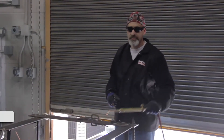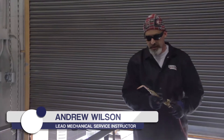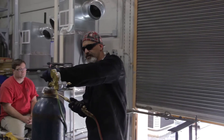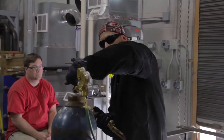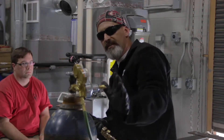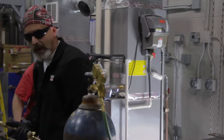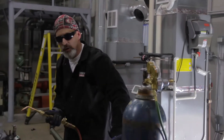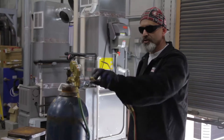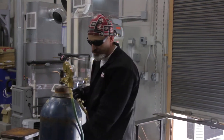It's time to strike the torches, but before that we've got to set our torch pressure — the actual pressure leaving the regulator and coming to the torches. We've performed our entire leak check on the heating unit, and now we're going to set the pressure. We always want to make sure our valves are all the way open, but they're closed because we performed the leak check. So we're going to open the oxygen all the way, standing to the side away from the set screw, and open the gas very slowly, turning no more than a turn and a half. Back your set screws completely out, because we're going to be setting our pressures and we want to start at ground zero.